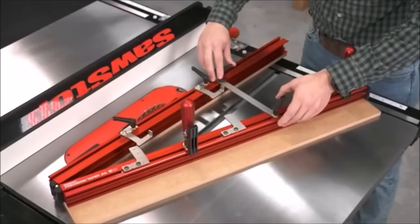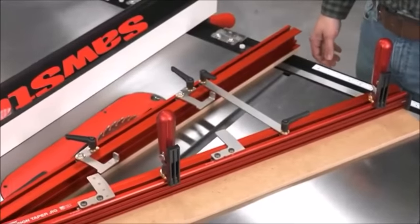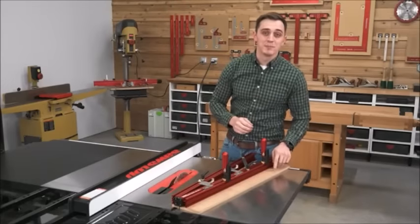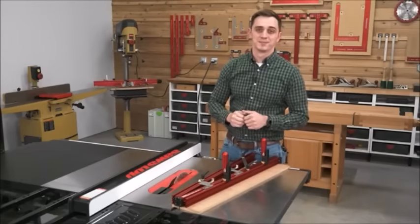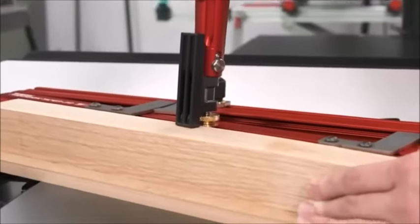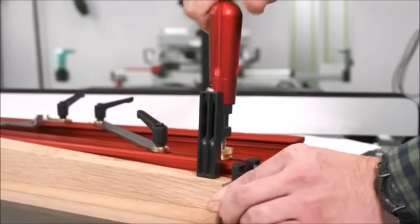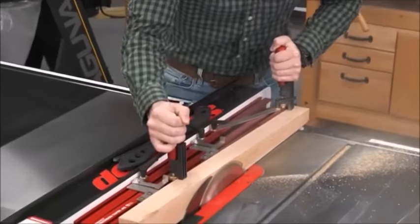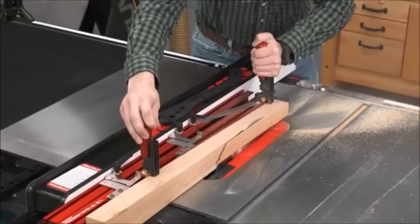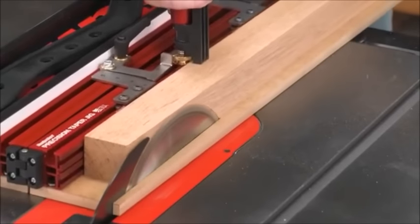For anything that lands between the lines or even wider angles, the clamping bar will hold the jig by itself without the angle index. Accuracy and safety are enhanced by the MDF sled and quick-release clamps, which are simple to use no matter what your project calls for, with a clamping range from 3 inches down to 17/32nds of an inch. The clamping handles also serve double duty as convenient gripping points for pushing the jig.